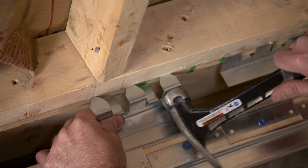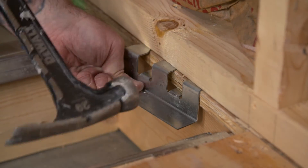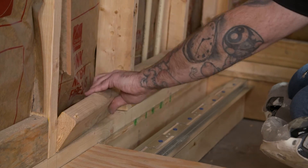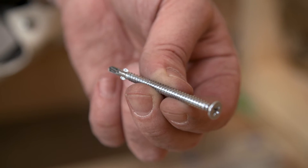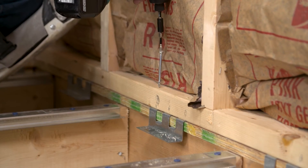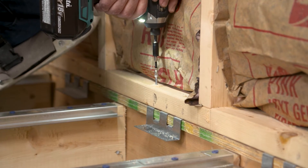Place a C bracket between joists below the base plate. The metal tabs will fit over and under the three-quarter inch plywood. Tap into place with a mallet or hammer. To fasten, perimeter blocking will have to be removed. The larger self-tapping screws are used to secure the bracket at two locations — one in the left tab and one in the right — by driving the self-tapping screw down through the bottom plate of the framing. Always check the bracket installation for level during the process. Repeat these steps for the remaining brackets needed alongside and rear walls.